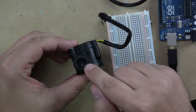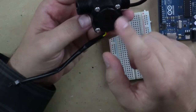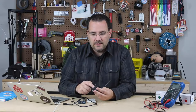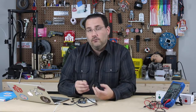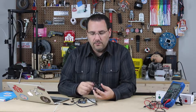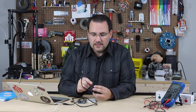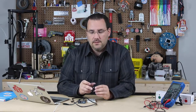If you can see inside - I know it's really hard - there's a little water wheel in there, and there's a magnet and a hall effect sensor. Every time that wheel spins, the sensor triggers a high or low, which makes it really easy to work with, but also a little inaccurate. Basically every time the sensor is triggered, it's the equivalent of about two and a quarter mils.